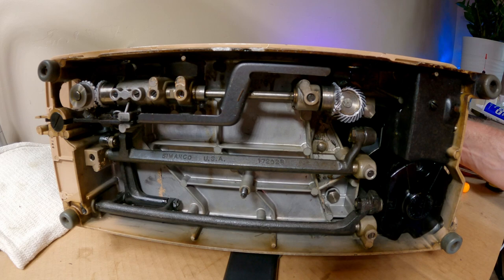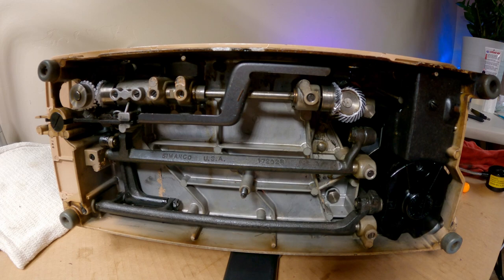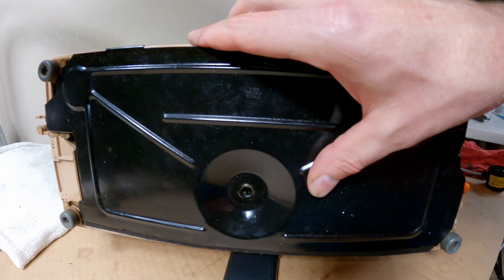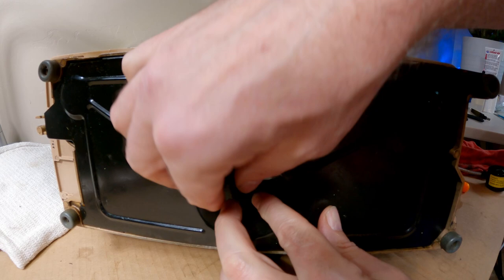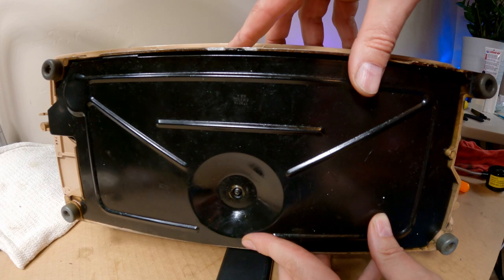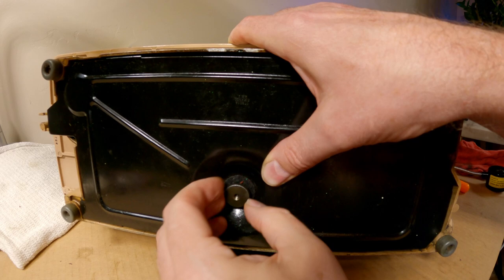I'll take a tissue and clean up some of the excess grease — we don't need a mess, we just need it on the gears. Look at that — perfect, happy about that. To me that looks serviced. All I need to do now is put this lid back on. I'll stick it in here, grab the felt washer — it's bent and under some pressure, not sure if that's from the factory or from being sat down wrong — stick the washer on, grab the thumb screw nut, screw it in, and that's it. She's good to go.